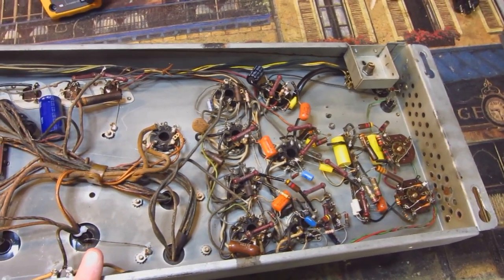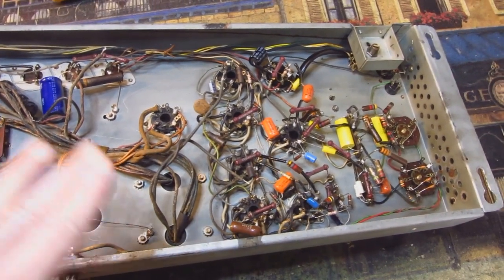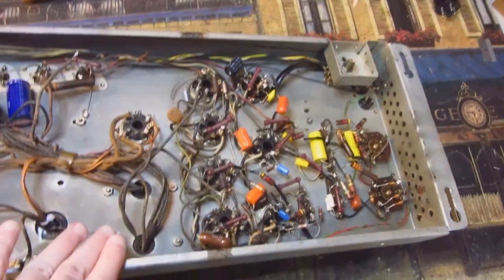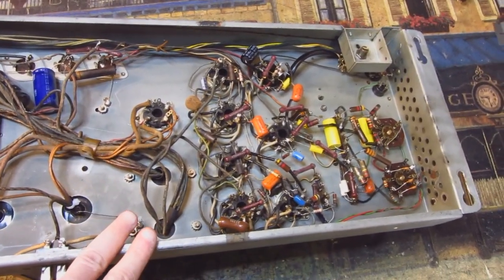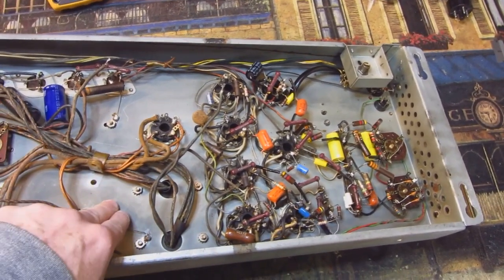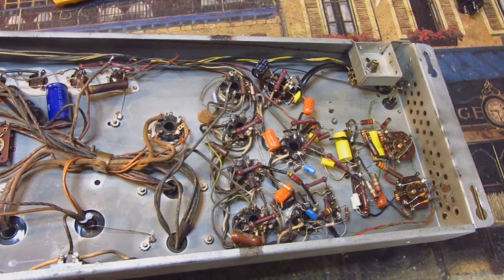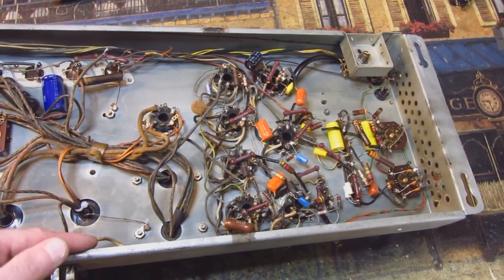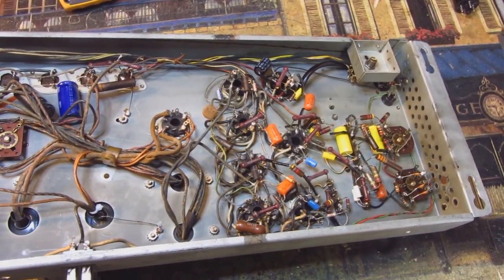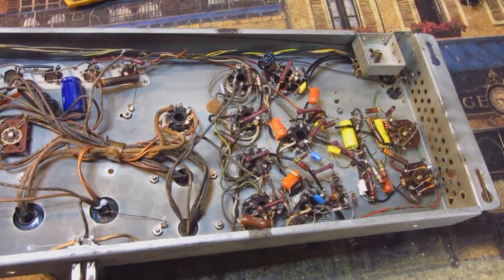My suspicion was right, and this was actually a quick troubleshooting project, although it's going to take more time to replace. The output transformer is bad. The problem is you're getting leakage between the primary and the case — a common problem as these transformers are getting old. That's why I don't even think it's smart to try to find an original replacement; you'd still be swapping in a 70-year-old part that was probably stored in less than ideal conditions, and you're just probably asking for the problem again.